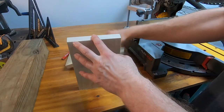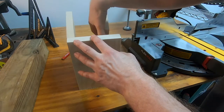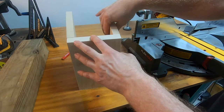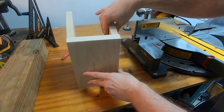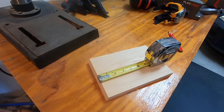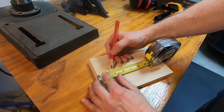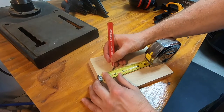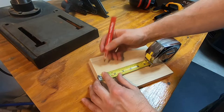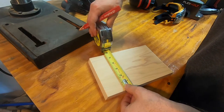To give you an idea of how the birdhouse is coming together so far, I'm just going to stand up the two sides and the front so you can see kind of how it goes together. Here I'm measuring the location of the hole for the entrance for the birds. So I'm measuring about 1 7/8 inch from the top and centering the hole left to right. This location,